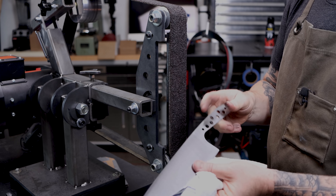The other thing I really like about this is that when you build it this way, your platen backer stays on the machine. It's just two half-inch quarter 20 bolts you have to remove to swap back to the high carbon face or mild steel backer. It's literally two minutes — it'll probably take you longer to find the wrench than it will to actually swap out the platen.